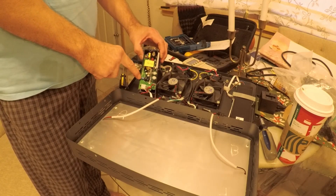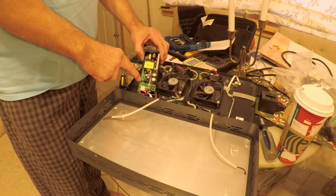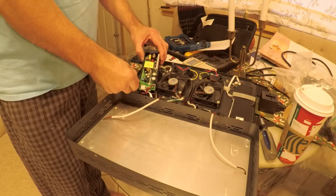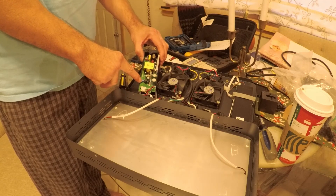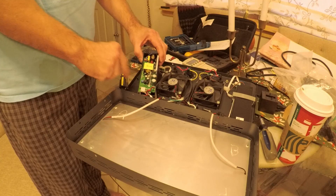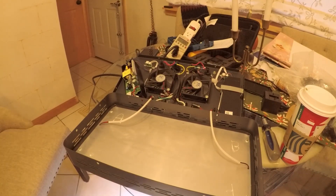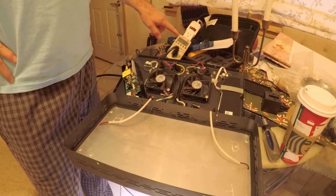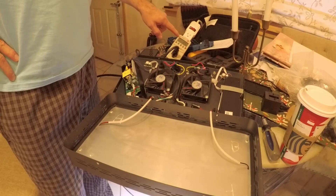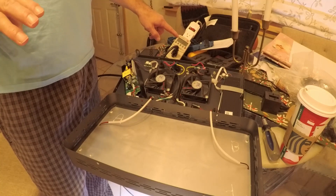The potentiometer is right there — that's what we're going to turn. On some of these black box LEDs they have a dab of silicone on this, and all you have to do is scrape it off with your fingernail — it will come right off — and it'll expose the little adjustment screw. In the sake of making this easy, I already have a Kill-a-Watt meter. We're going to go ahead and use this — this is probably going to be the easiest way for you to adjust this.